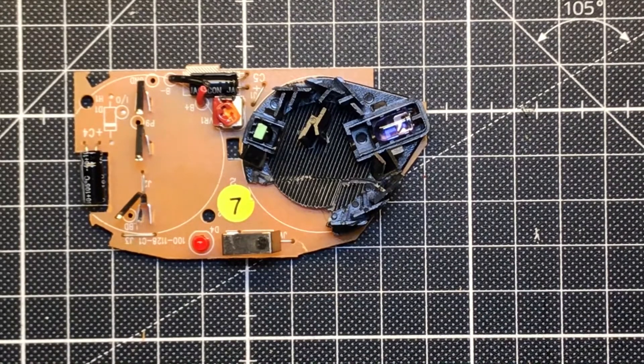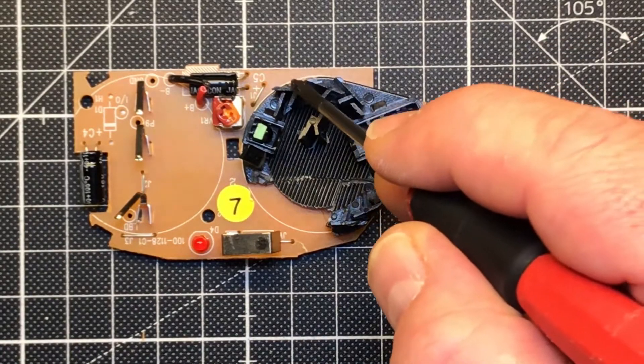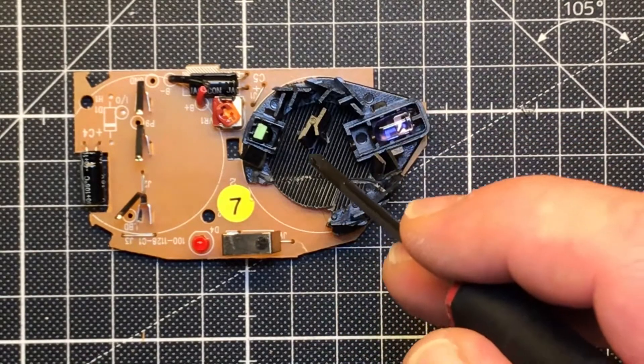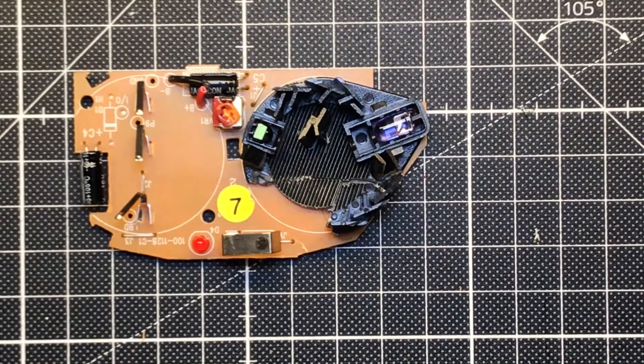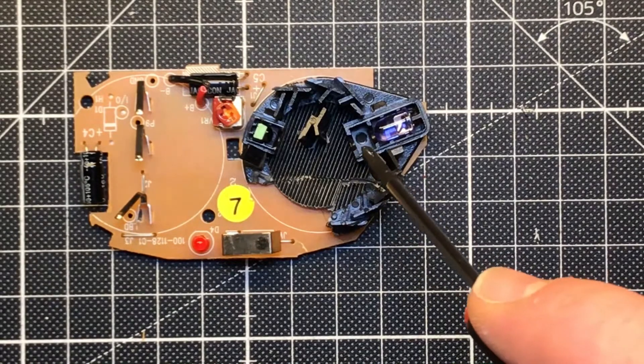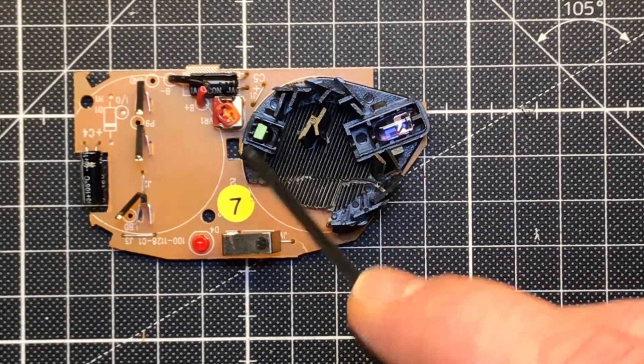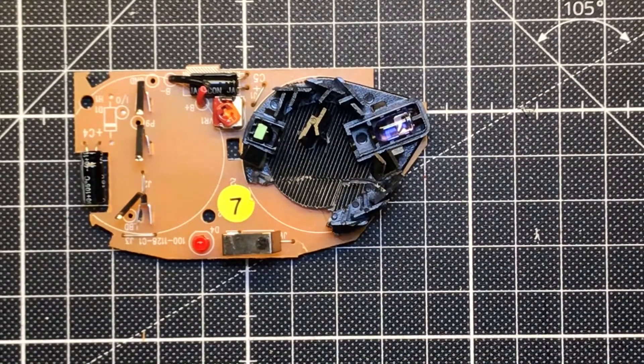But when some dust or smoke particles come into the air, the air becomes reflective. The air goes through the slits into the chamber, and this air with smoke particles will now reflect the IR light — so the light has a chance to be detected by the photodiode. Then it's amplified and checked if it is not a false alert, and it will beep.